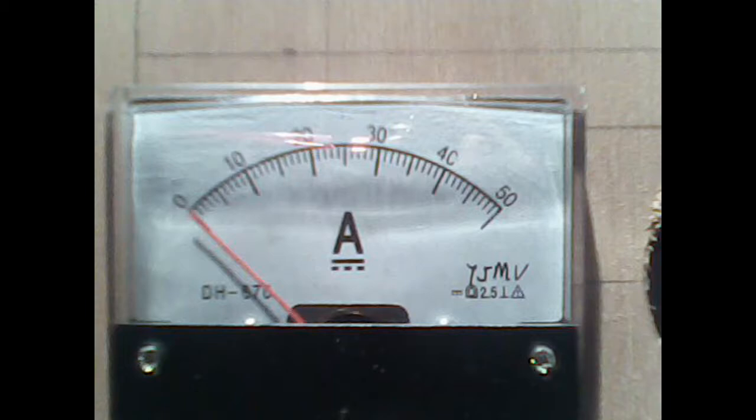This is a 50 amp, and that is for the cigarette lighter sockets. So these are actually cigarette lighter sockets. That's 15 amps maximum. And there's another two over here. They're both 10 amp each, so as you can work it out yourself, 35-40 amps nearly.